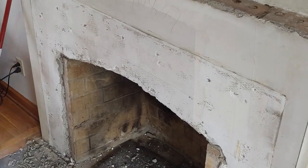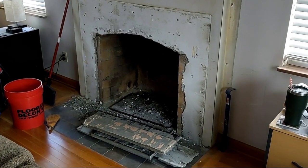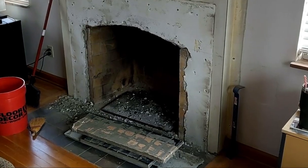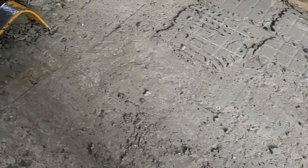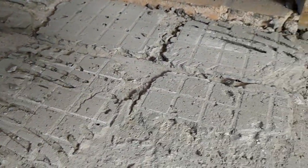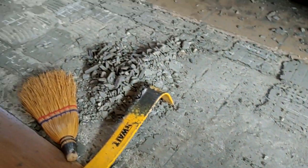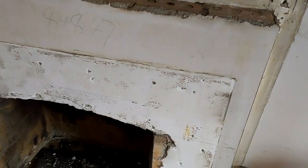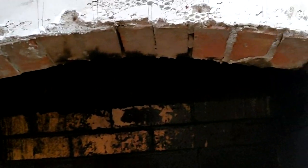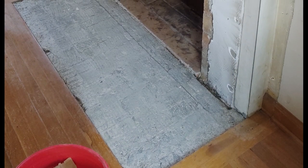I was really glad that came off nice and easy. The hearth was still untouched and that was what I had to address next. I got the tile up from the hearth — it was a tough job using a pry bar and a hammer. I needed to shave it down a lot so I could fit the new tile in there. And I discovered an arch in the fireplace that I didn't know existed beforehand, which changed my plans a little bit. At this point I had everything stripped down and was ready to start framing the new feature wall.